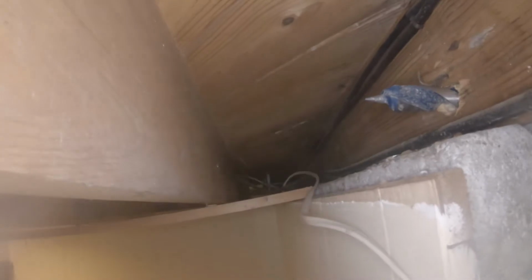So I'm just going to cut this line off back here and I'll move it over, get it away from the electrical panel, shoot it into there, and then bring up, once it comes up this beam, I gotta put a long enough piece up here. If I put too short of a piece, this won't be pitched. So make sure that piece is long enough.